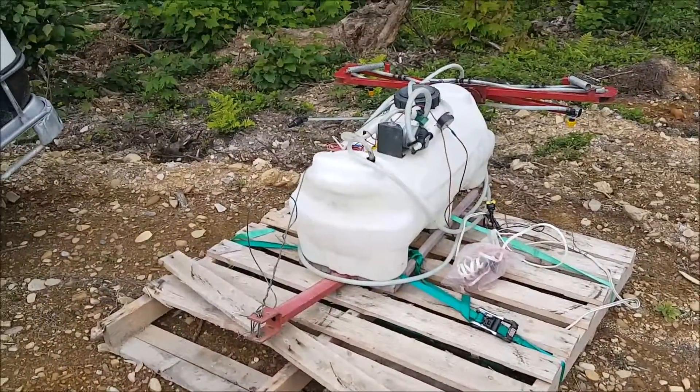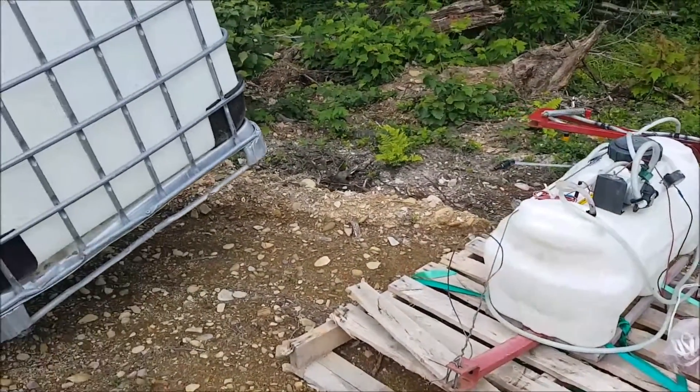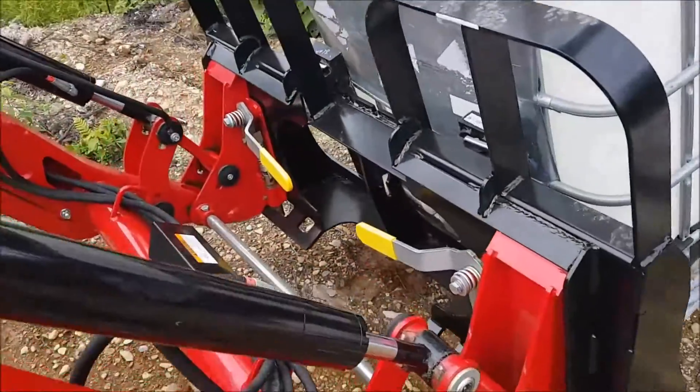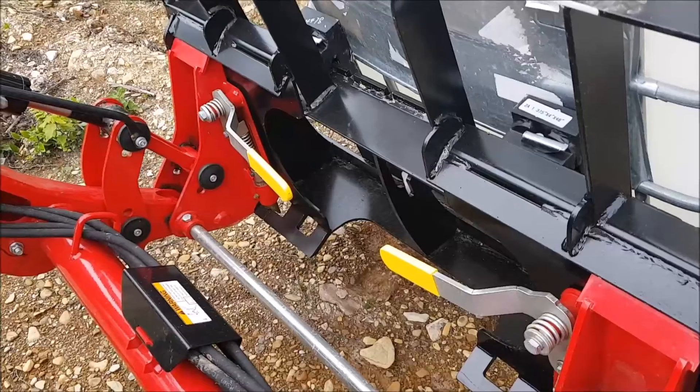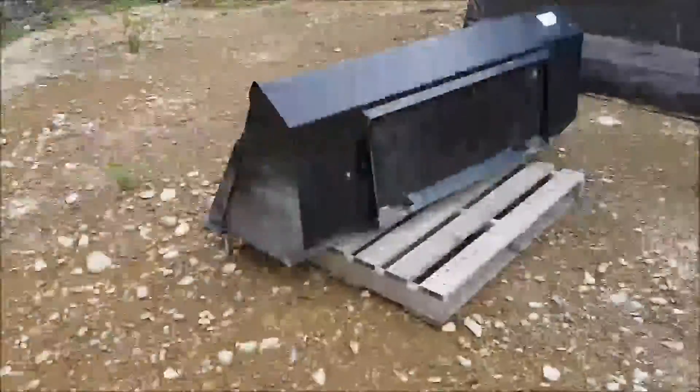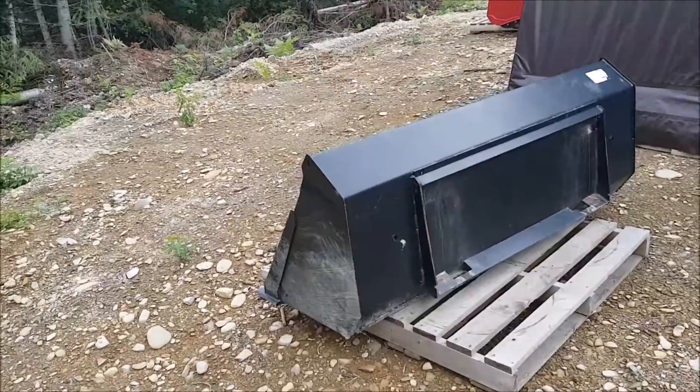They help to move totes like this, and I also use a sprayer when I need some spraying done — it's a skid steer attachment. You just pull on these two levers, they drop down, and you go pick up your bucket and on your way.